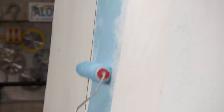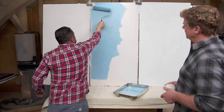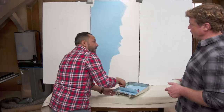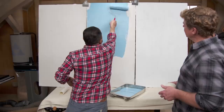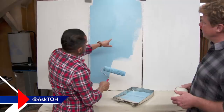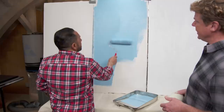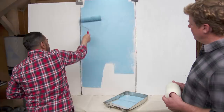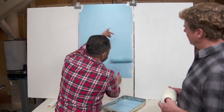Start at the bottom, going on a little angle — that way you don't leave any roller marks on the surface. Going asymmetrical helps. You can see the roller getting good coverage right into those lower spots with the three-eighths nap — it didn't skip over any of them, it filled right in. On the second pass, overlap about 30 to 50 percent — by design — to get rid of any roller marks. You can go all the way across, then go back to make sure everything is nice and smooth with no imperfections.